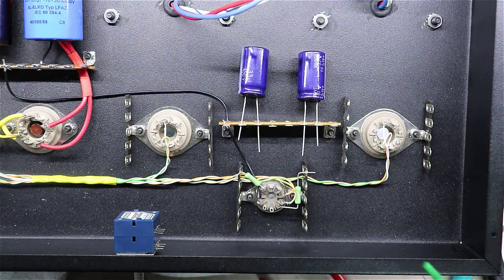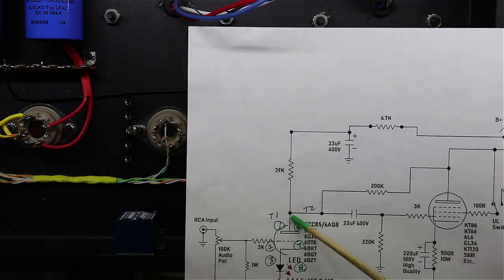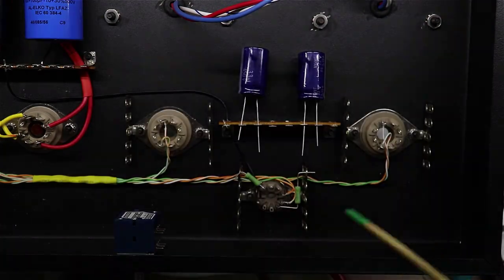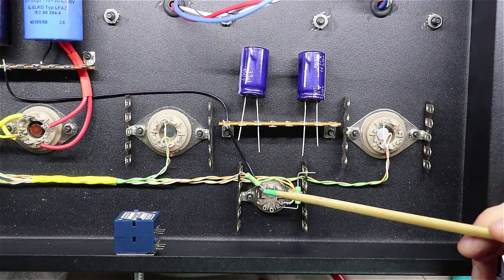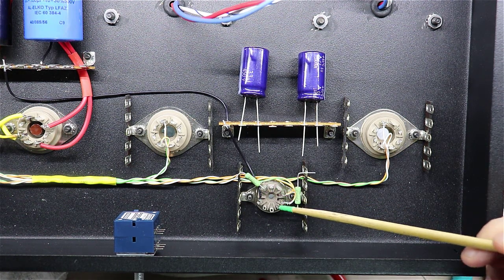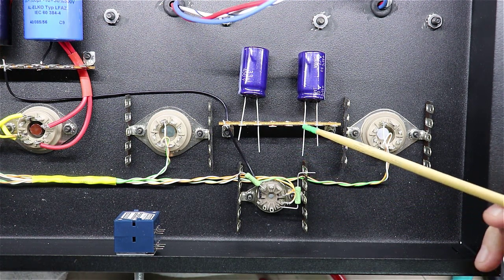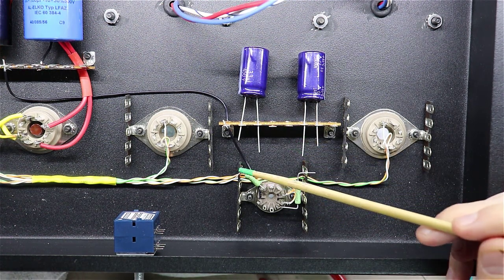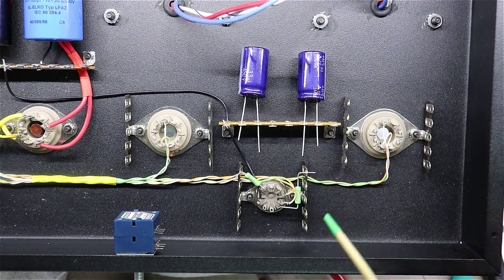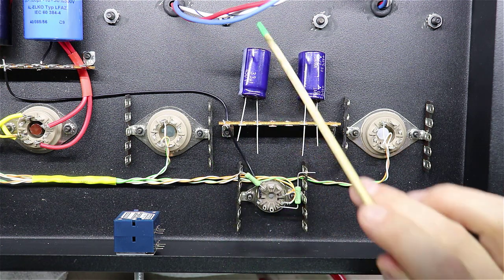And what I've been wiring thus far is I went ahead and ran pin 9 to ground, and I'm going ahead and connecting these 39K resistors. So I basically ran from here on pin 1 over to this lead, and from here on pin 6 over here to this lead, and then I'll be able to tag from that lead to this positive right here, and I'll be able to tag from here to here, and then I'm going to have to feed this negative over with a ground wire over to here, and I'll have to tie these 2 in with this ground.